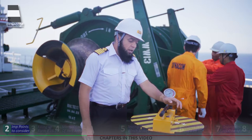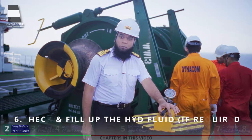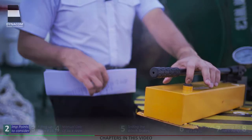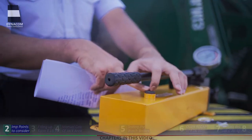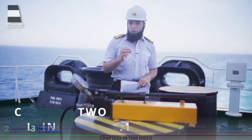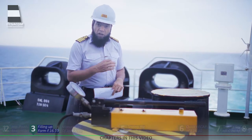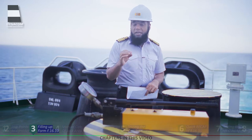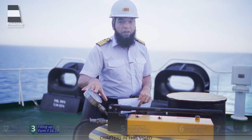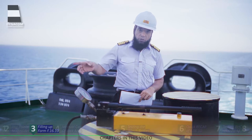At the same time, please make sure that the hydraulic fluid in your pressure jack is up to the mark — it is very necessary to build pressure inside a pressure jack. This is the point from where the liquid is filled up in our pressure jack, and before starting the test we have already ensured that the liquid is properly filled. To start with, we have to find all the relevant materials from our manuals in order to fill form F16.10. Filling up form F16.10 and finding out the correct pressure that your jack has to apply to perform a brake holding capacity test is very important and should be the first step whenever you are calculating the amount of pressure to be applied.